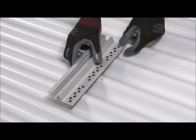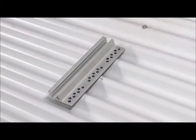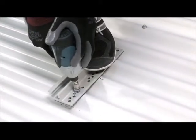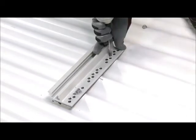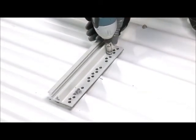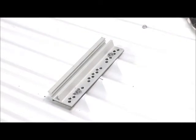To install a Bigfoot, first align the mounting holes in the flange over the center of an east-west framing member. Shift the Bigfoot to align the mounting holes with the peaks of the corrugations while staying centered over the layout mark. Drive two self-tapping sealing lag screws through the corrugated peaks at either end of the Bigfoot, taking care not to crush the roof surface. EPDM on the bottom of the Bigfoot provides a watertight seal at the roof penetration, eliminating the need for additional sealant.